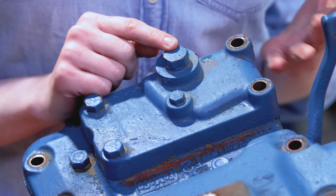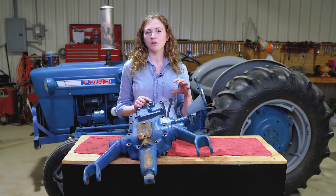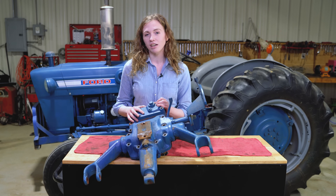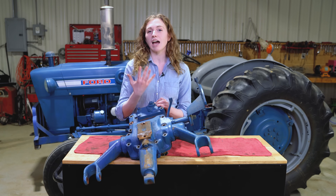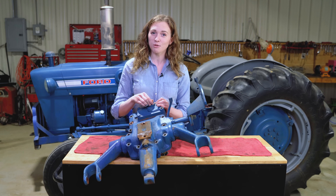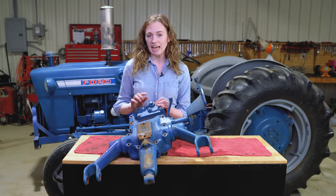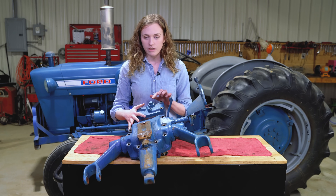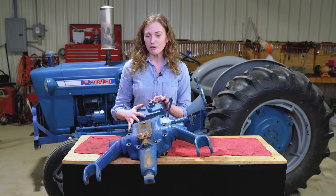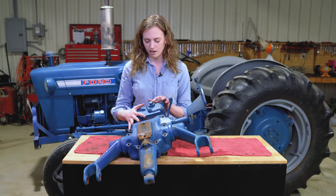This plug is the one I was referring to that will help you test if your pump is working and pumping hydraulic oil all the way up to the top lid. You can remove this plug, start your tractor up, and see that the oil shoots out — it will come quite high, so make sure you're ready for it. This plug is also where you would put a gauge on your system if you ever wanted to test what kind of hydraulic pressure you're getting.